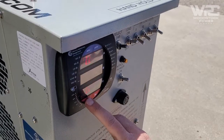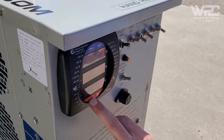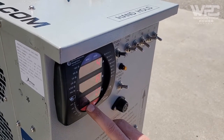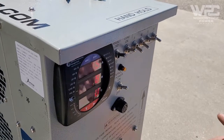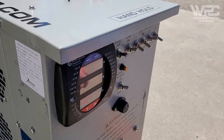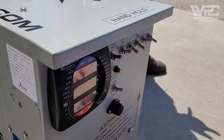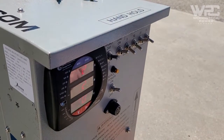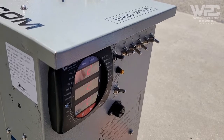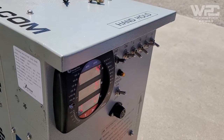We're looking at 60 Hz with no drop, and voltage is steady at 120/120/240V with no voltage drop. Temperature inside the unit has been good, oil pressure has been good, and cooling temperature has been good. Make sure you monitor everything during a load bank test — it's very important. Write it down every 10 minutes so you can follow up on your work and make sure nothing is out of place.